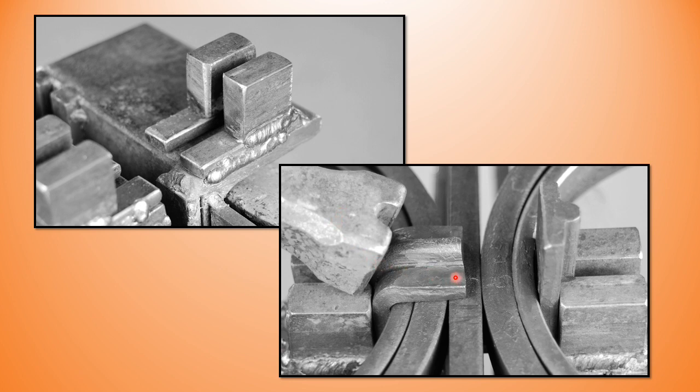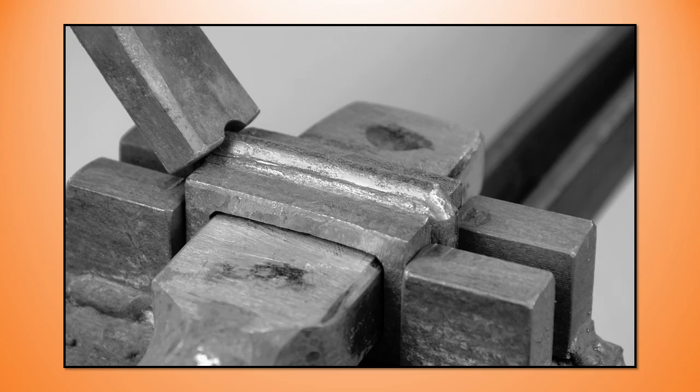And then if you're going to use the forged collar, as I'm showing here, to make this little flat across the corners, then you can see that I've got some chatter marks here from some tooling, this tooling in fact. So these blocks need to be cut down to accommodate this tool for this move.